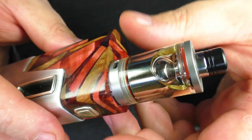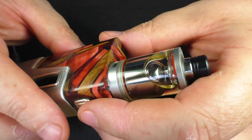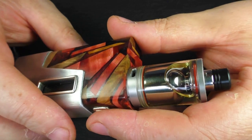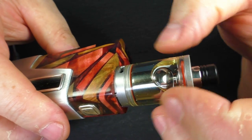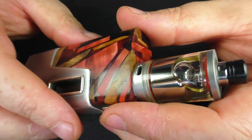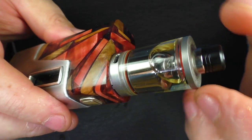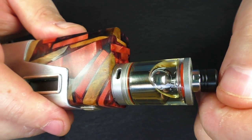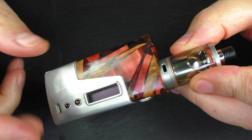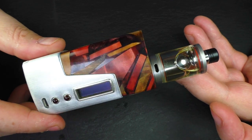This is pretty much bog standard, but I've undone the juice flow control, turned my wattage down, and I'm going to break this in and make sure I've got juice going to the wick. When you undo your juice flow control, don't set your wattage up to 30 or 50 watts straight away — break it in gently until you're sure it's wicking properly. And there it is sitting on the Optimus 18 from Amber Mods, and I think that looks bloody gorgeous.